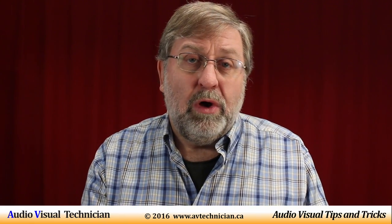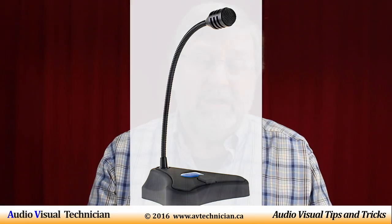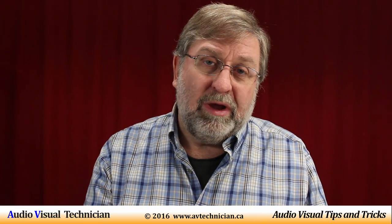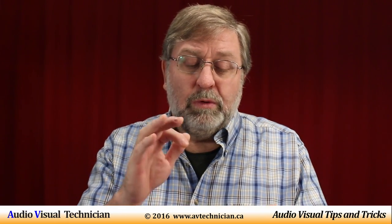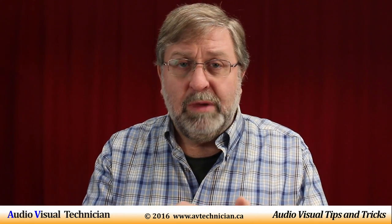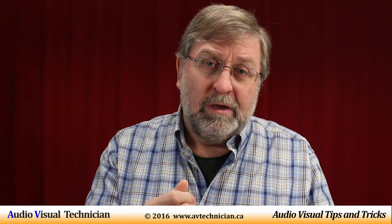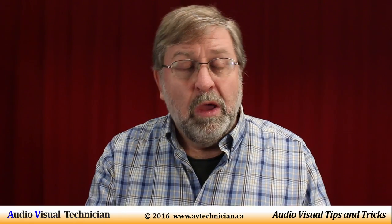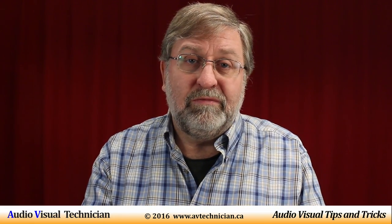There is another type of microphone called the push-to-talk microphone. These have come in a wide variety of quality levels, especially regarding the push-to-talk switch. If the microphone requires phantom power and you didn't pay rock-bottom price for it, you probably won't have any trouble feeding phantom power into the device, because the push-to-talk cuts the audio channel but doesn't cut the power. But some of the cheaper ones cut both the phantom power and the signal when you push the button, and every time you push it you get a little crackle — a sign of either a low-quality microphone or a microphone that doesn't actually need phantom power but is being fed it, creating the potential for crackle or even a short out.